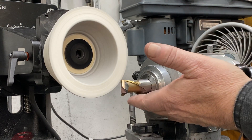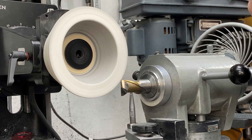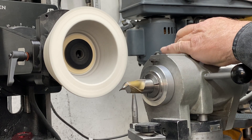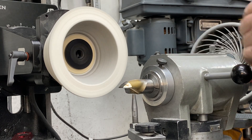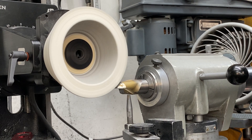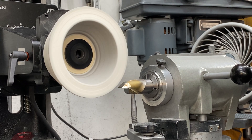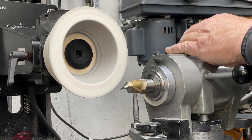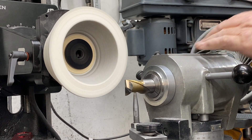Remember the tool is kind of flush with the bottom of the wheel from a basic height perspective. As you can see it's a pretty good height for the secondary — gives you a nice secondary, cuts a lot of clearance out of the way, which is good. So with the spindle set to zero, we're just going to do the center gash and I'll show you an easy way to do that.